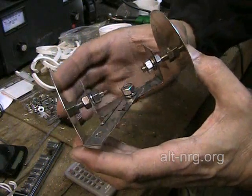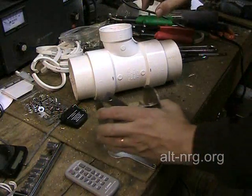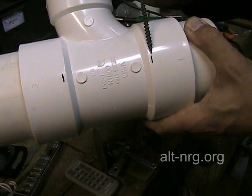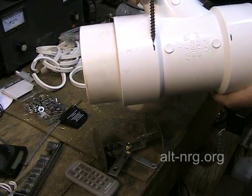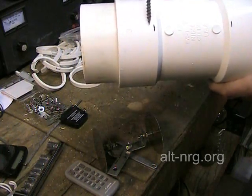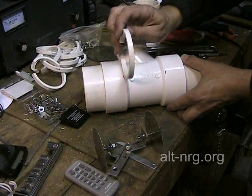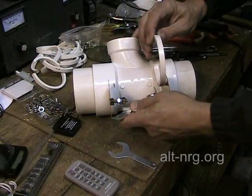It should conduct very well, and it is two and three-quarter inches long. If you'll notice on the edge of the T, I have drawn a couple of lines with my Sharpie — one here and one here. This is how far the section of three-inch pipe inserted into the T extends, ending right there inside the pipe. I want my plates to sit five-sixteenths of an inch beyond each end of the pipe, because there's going to be one last shim in here that acts as a backing plate for the stainless steel plate. So inside the cell, we're going to have a shim right here, and the cell plate sits right up against it, and another one on the opposite side.